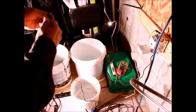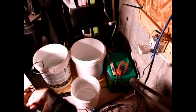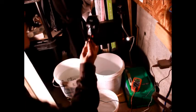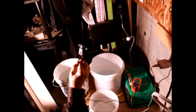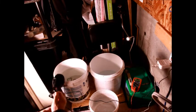Let's try it - turning on the pump, standing back. There you go - that is a faulty pump. If I remove the ground probe, no more grounding, and that pump will continue to run. Seems like the Coralia pump has somehow sealed itself up and it's not faulty anymore - we saw a fault earlier. I would say, other than the fact that I crisscrossed the wires, this was what was causing my GFCI to trip in my fish tank and what was causing me to feel electricity when my fingertip touched it.